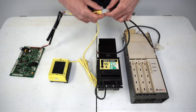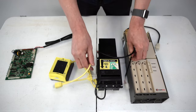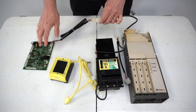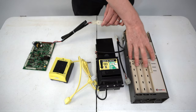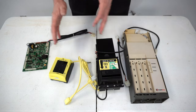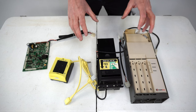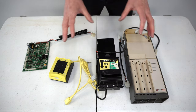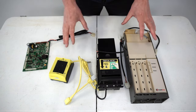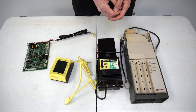I had him turn the power off, disconnect both the dollar bill acceptor and the credit card reader, and connect the coin changer up to the board directly. Turned the power on — did the board lock up? Yes, it did. So the problem was with the coin changer. Understanding how your devices connect to the MDB daisy chain allows you to eliminate devices to troubleshoot things, or if you're adding or swapping out a credit card reader, dollar bill acceptor, or coin changer, understanding how these devices connect will really help you in the long term.